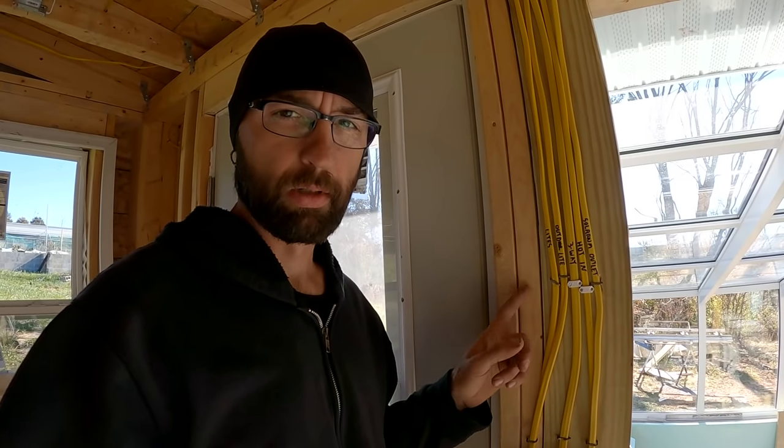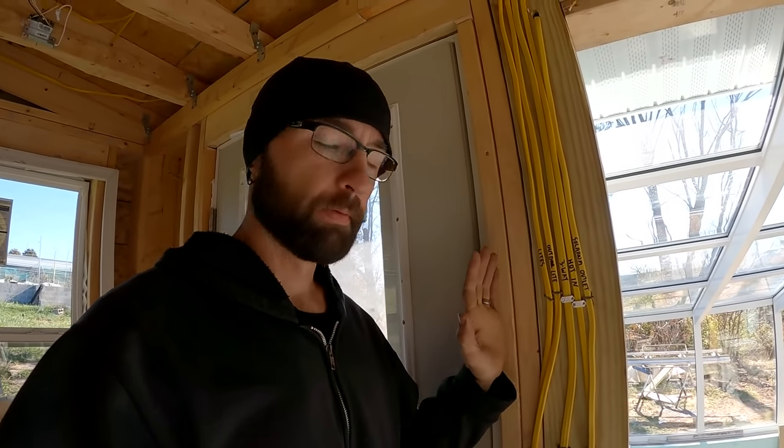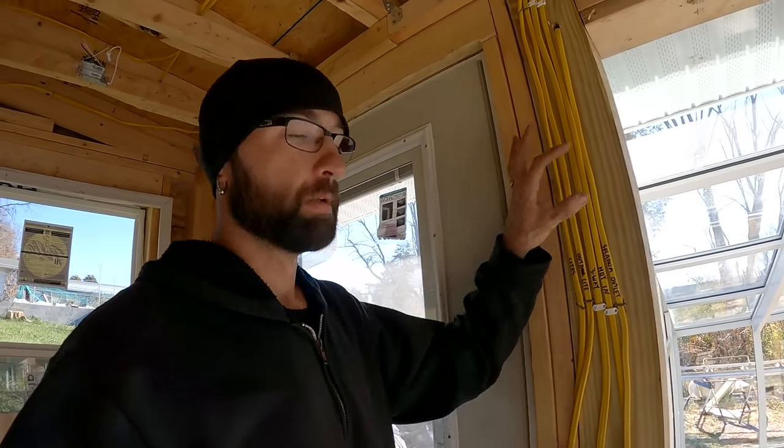Right here by the door I surface-mounted the wires because I didn't want to cut into the structure — the beam holding up the roof. I'm going to have to build this out and then cover this whole thing with a sheet of metal, because I'm going to end up with less than an inch and a half to the surface and I want to protect the wires. Also, it's code. So this is going to be a little bit more fabrication than I was originally intending, but it's how it has to be.